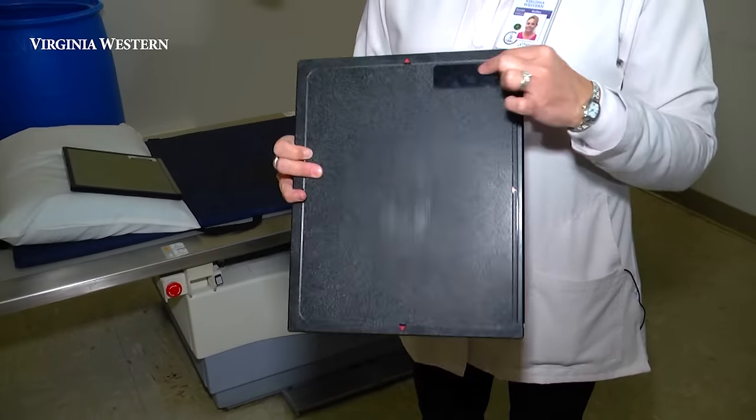On this mixing system, for this processor, it has indicator lights that let you know that the mixture has become low and needs to be added. The process of mixing the chemicals is very specific. These chemicals can be very dangerous if they touch your skin or are inhaled. It is preferable that when you are putting new chemicals into this tank that you wear a mask and gloves.